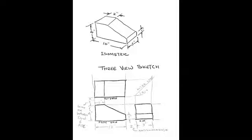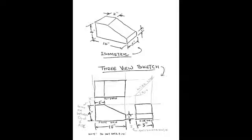As we go along, we will mark out all the little dimensions, like the height of the left side and the little length of that upper flat, the height of the right side flat, and then the line that goes between the top and side views. Once we get our views laid out, we can darken the lines, and we can also provide dimensions. Usually dimensions are added later, but I added them as we went so you could see what numbers I'm using. So we've got the front, side, and top views.